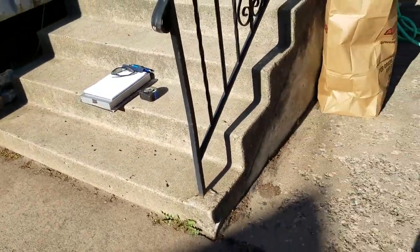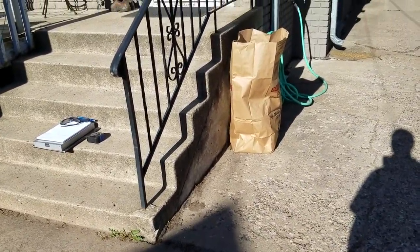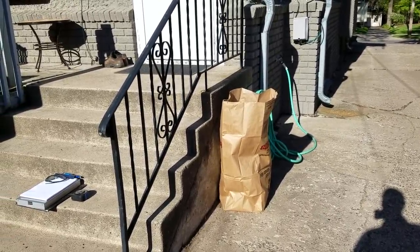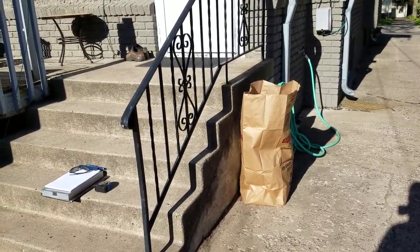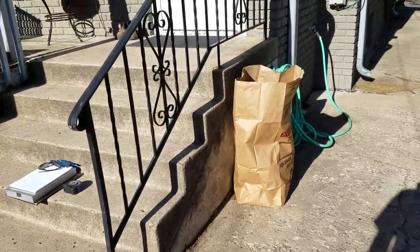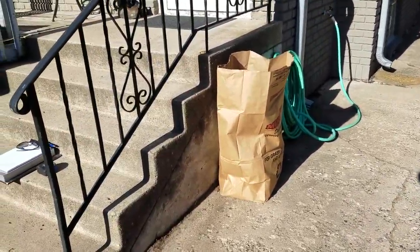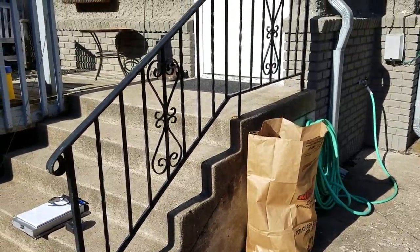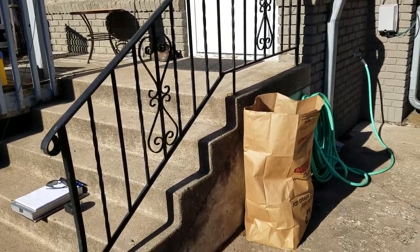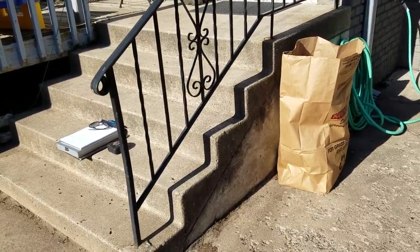There'll be a little cutting involved. I'd want to drill some rebar in and core fill it just to keep it strong and attached to the step. We will need to lath it and brown coat it just to give it continuity, especially on the side where it's transitioning from the step to the cinder block. We're doing that on both sides of this step.